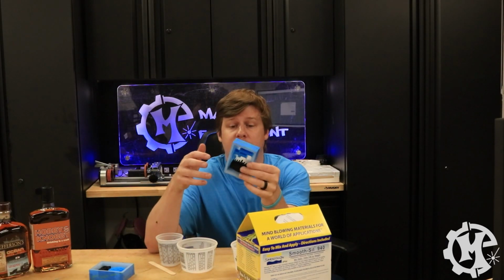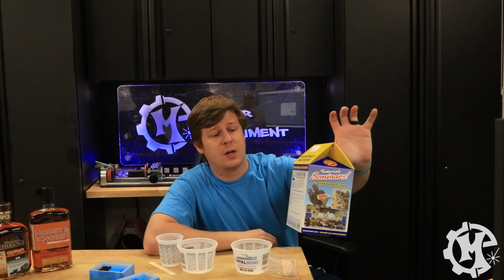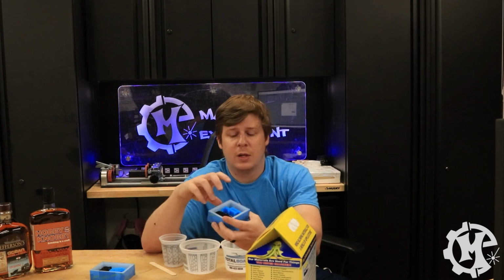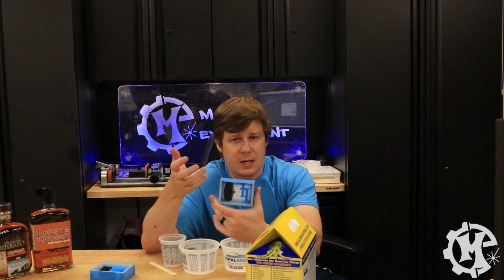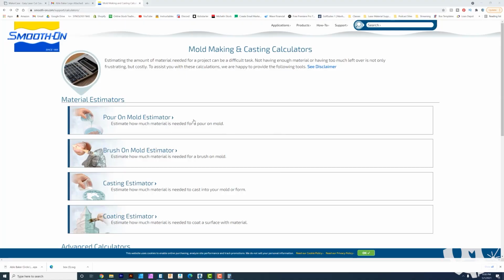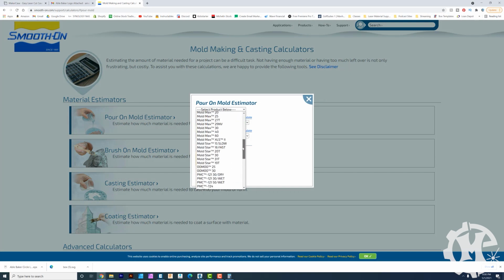Now that I've got the molds ready, I'm going to be using the Smooth-Sil 940. And I need to actually figure out how much I need to make in order to fill these molds. So I'm going to put a link in the description to the calculator that I use from their website. What you're going to need is the cubic volume of the mold and the cubic volume of your pieces inside the mold, and that will tell you how much you're going to need to make. I'm going to grab these measurements and show you how to use the calculator. So here at the calculator, this is a pour-on liquid, so it's going to be a pour-on mold estimator. The product for me is going to be the Smooth-Sil 940.